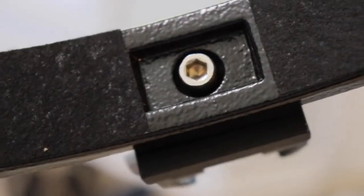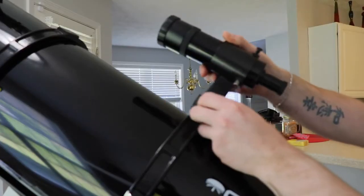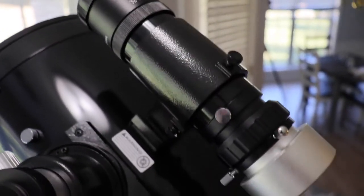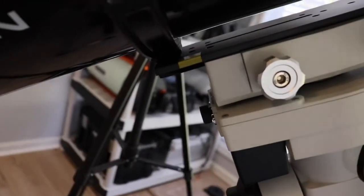I did some customization to this one by adding a Losmandy bar for mounting the rings on. I placed the finder scope on the back of the OTA by removing the thumb screw attachment and used a cap head from underneath to attach the finder scope shoe to the ring, then the finder scope to that. On the front I added a 50 millimeter Orion mini guide scope, which paired perfectly with my old bulletproof Starshoot Auto Guider. The placement is just right to allow the finder scope to still be useful, though I do get a slight red glow at night from the SSAG LED, but it's not enough to cause any issues. Fast forward, with the rig loaded up I carefully balanced everything and then used yellow tape at six different points to aid in fast setup for later down the road.